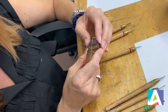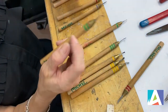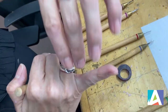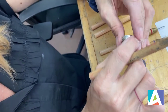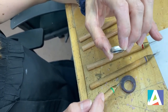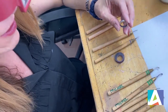The other tools can be used for hollowing out the inside — these green tools — because you need to hollow out the inside so that it's not so heavy. When your ring is in wax it's light, but once you cast it in metal it's quite a different story. So you have to have your ring very, very light.